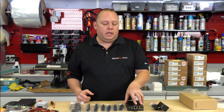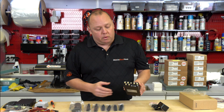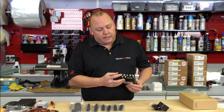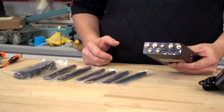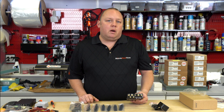This is a dual CAT-12 mobile router, which is very popular. We're actually releasing this in our new Ultimate Road Warrior LE bundle as the Transit Duo is being phased out since they no longer have the components to manufacture it. Flipping this around, it's identical to the Transit Duo from an antenna and hookup perspective on the back — we have dual MIMO antenna ports for modem 1, dual MIMO antenna ports for modem 2, and dual Wi-Fi ports for local Wi-Fi 5, which supports 2.4 and 5 GHz Wi-Fi with 2x2 MIMO technology.